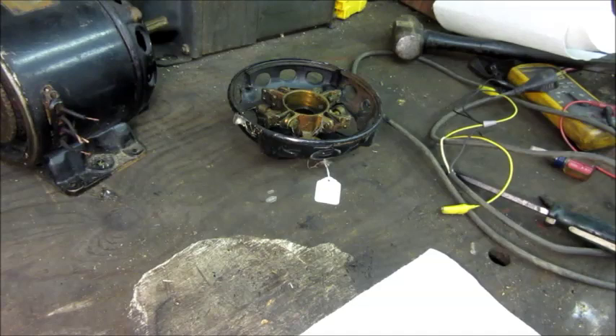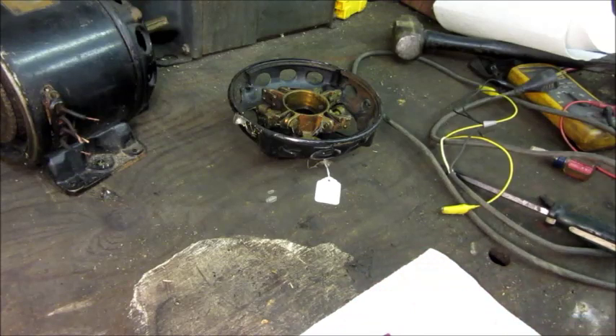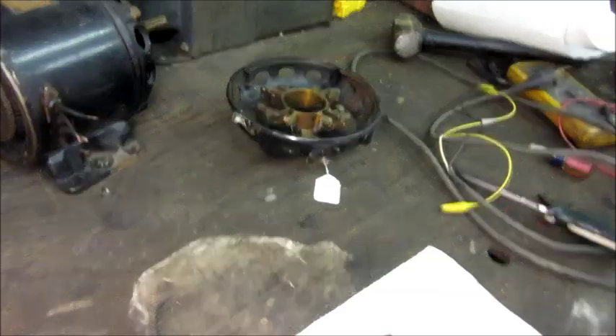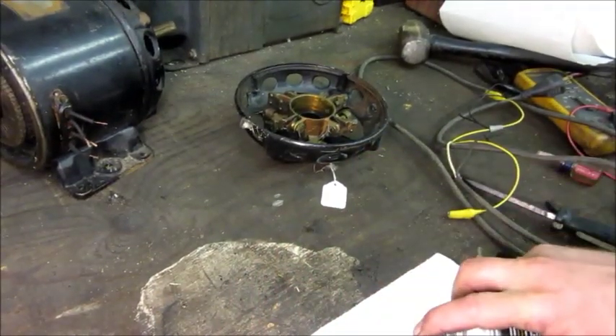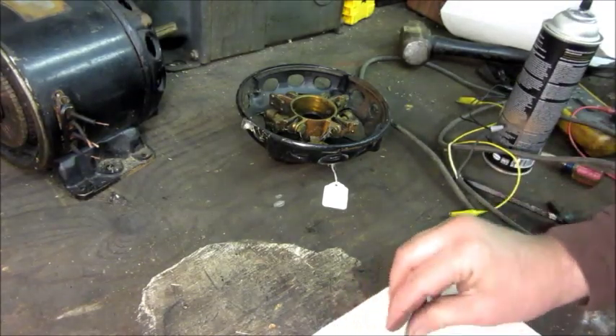The Delco motors like this have a wire bridge between the two pairs of brushes to help them always have a complete circuit. I know that Century doesn't have that, so if this has gum or grease on it where it's not making contact inside the brush holder, you're going to probably see a problem like this.